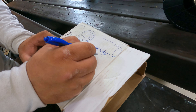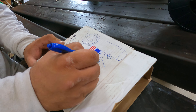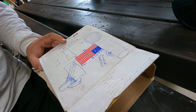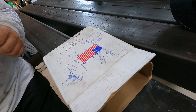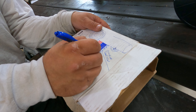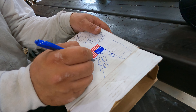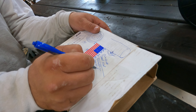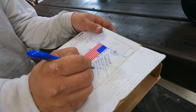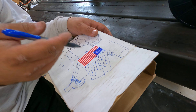This wire is called different things: Lincoln calls it something like 'outer shield,' most people call it dual shield — that's another term for it. When you look at the gasless wire, that's a flux core wire as well, and it's either called a gasless flux core wire, or it's called 'inner shield' when you buy Lincoln products, or it's called an open arc wire or a self-shielded wire. All these are the same — they're all flux core.